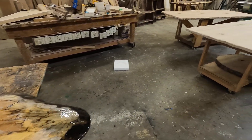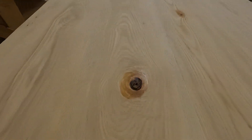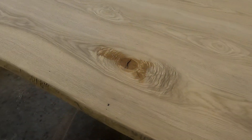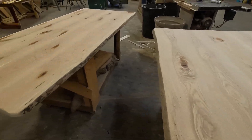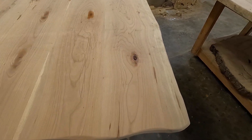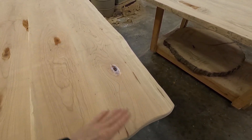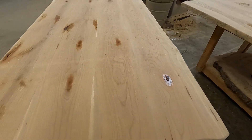I have my tables that I need to fill some voids. Especially with tables, where food's involved, I like to fill all that stuff — who wants big open sores? What I found is that you have to put a little bit of lacquer around where you want it, because epoxy goes in and actually soaks into the wood, and even with sanding and everything else, it always stays a little bit discolored.